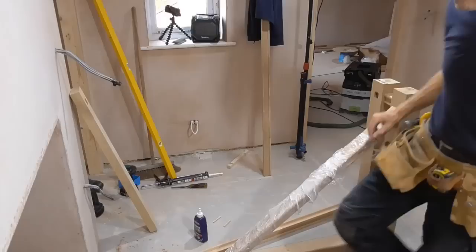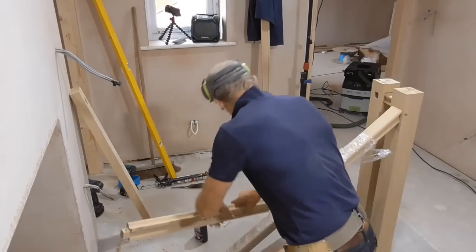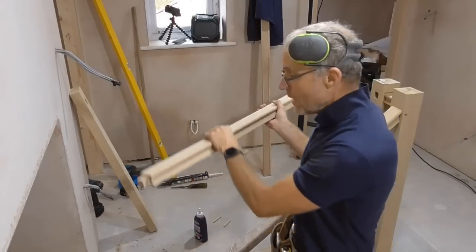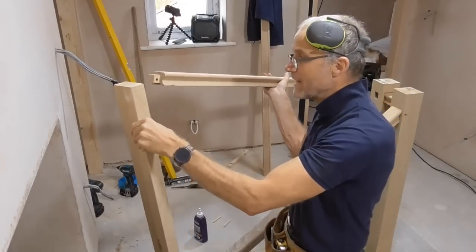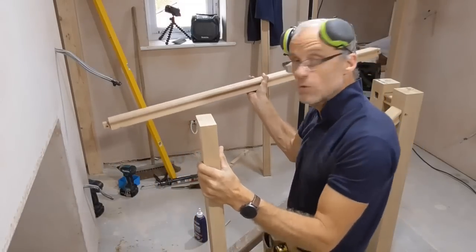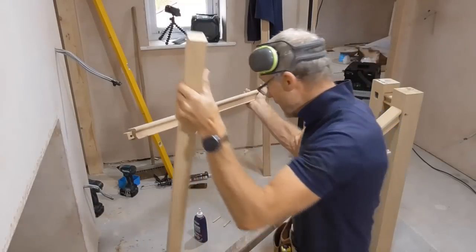Everything's done and ready with this handrail - I've mocked it all up, taken the edges off just off the newel end. I've put a leading edge on and that'll help me slide the thing in. I could be tempted to dowel this so it's not wobbly when I'm trying to dowel it in position, but having this loose allows a little bit more triangulation and tolerance to get the whole thing in. So let's get it glued up and get it all put in.